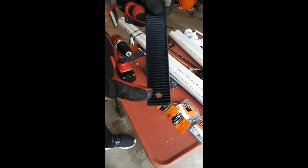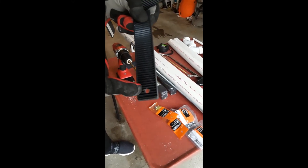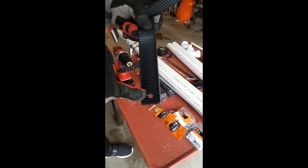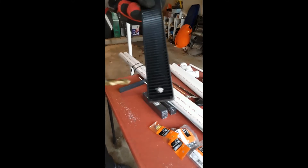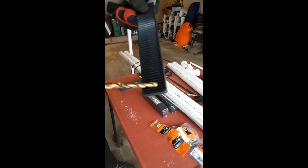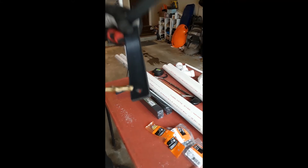Here's a completed one. I used the drill, which is the same size as the rod — 5/16ths — and I drilled through it to make the hole that the rod would fit through. The way I measured it: I started to drill after the second rivet. I basically put the drill in the center of the third rivet.